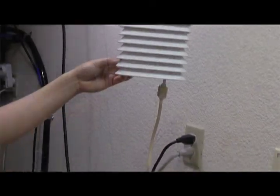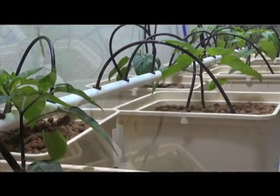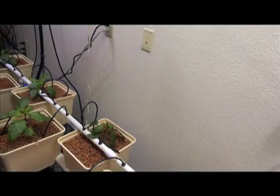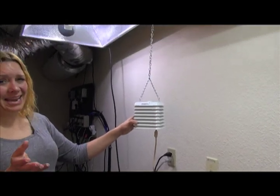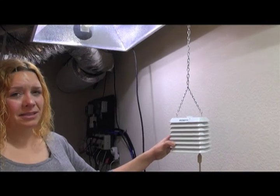You can add a second one of these sensors if your room is large enough. If your room is bigger than maybe a 12x12 or 15x15, you would want to have two of these. If you have an outside temperature that gets above 80 or 85 degrees on a regular basis, you may want to add an outside temp sensor.